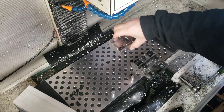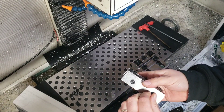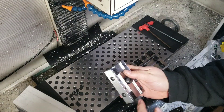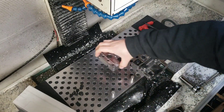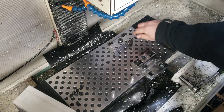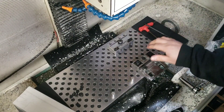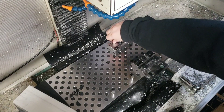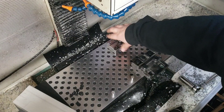Why this plate is awesome is their mod vise system — the modular vise system. This is the fixed side and there are parallels on either side. I saw a video where John recommends just leaving them floating so you can make sure they're flush at the table, but you can certainly snug them up once you've got it set. These are talon grips, and the other side just has a flat bar, but you could put talon grips or the bar on either side. You can set up the moving side of the vise system on either side, or flip it around to use the other side. You can really maximize the reach or the usable clamping area, especially with a smaller table like this.